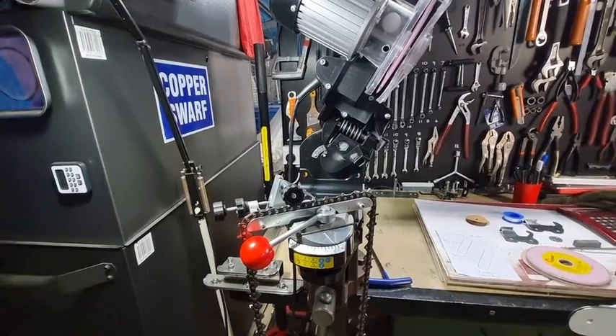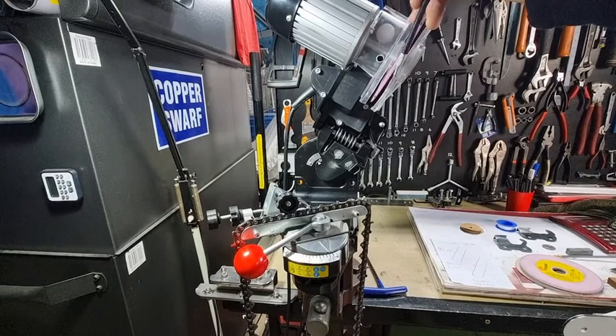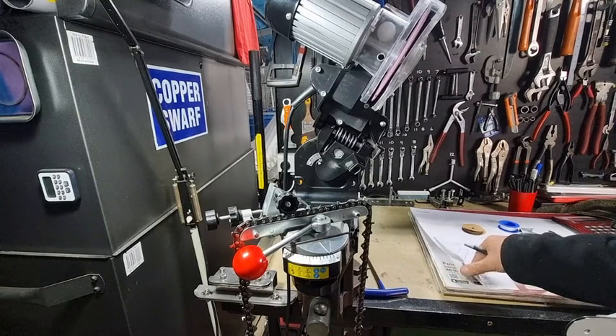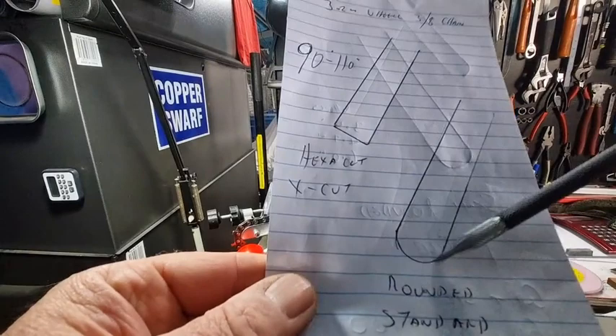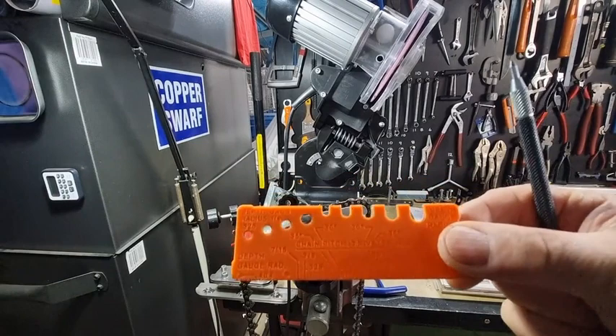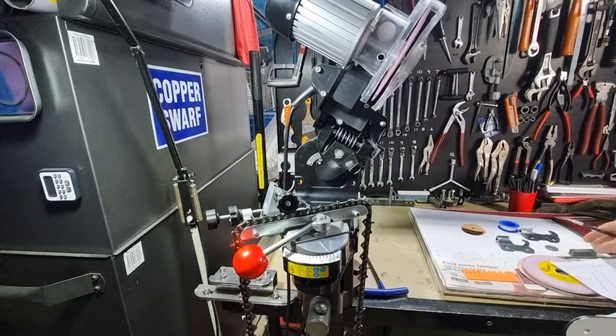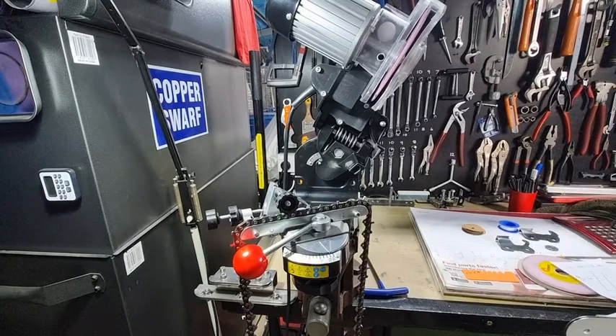What I'm trying to do today is talk about grinding wheel profiles. Somebody put a comment saying they were new to grinding and interested in profiles. Typically this profile is fairly standard — it's almost like a half circle. The whole idea is that you get a silicon carbide block, or I've got diamond files and diamond cards, start the grinder up and proceed to just run this very lightly over the wheel backwards and forwards.